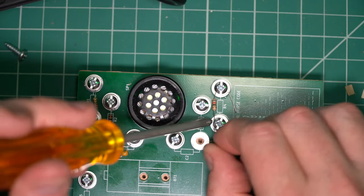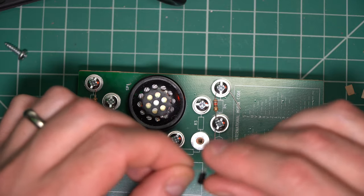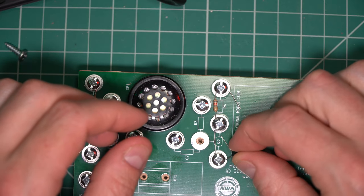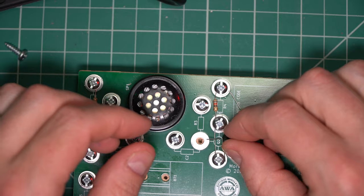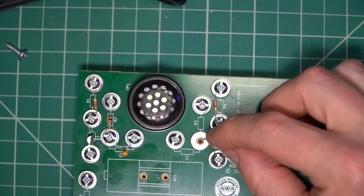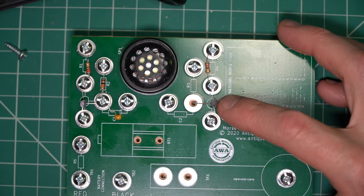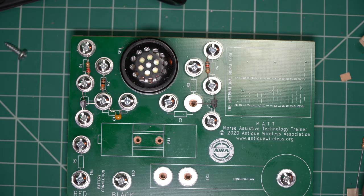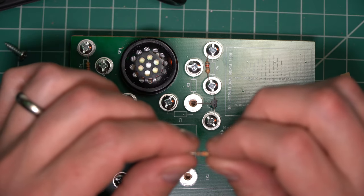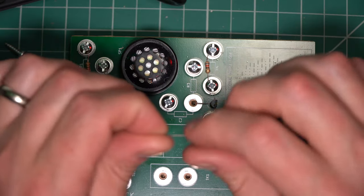It looks like this goes over the top again. And our other friend, the transistor, comes out. He's going to slide under this guy, and under this guy. So, trim the leads here. Resistor and transistor in place. R3. Brown, black, orange, gold is R3.